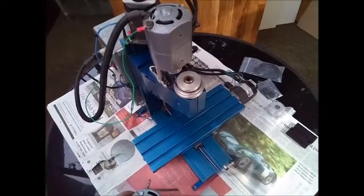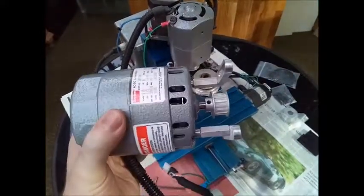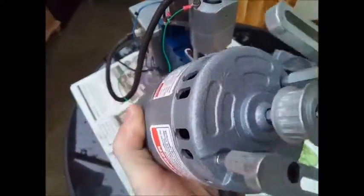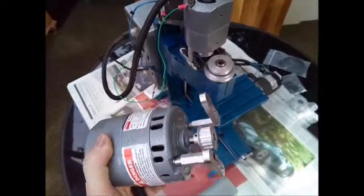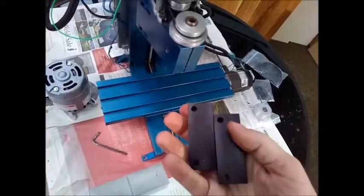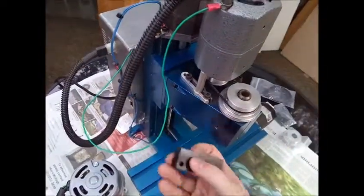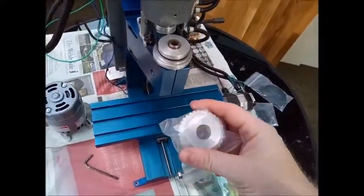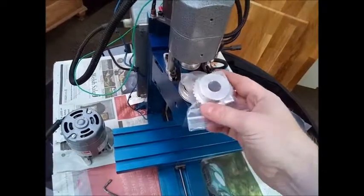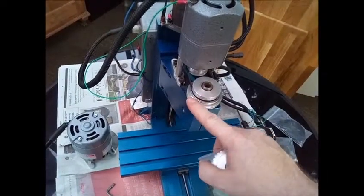What I got from Zymotion was the motor, the legs, the feet at the bottom with the gear on the bottom to turn the belt. We also have the spacers — they're anodized black. I think their new models of CNC mills are actually black. These spacers will bring the head outwards a bit. We've got a new pulley for the spindle to replace the old one — it's toothed, so you don't have the speed selection that you had with the original, and I'm wondering what difference that will make.